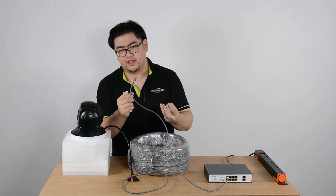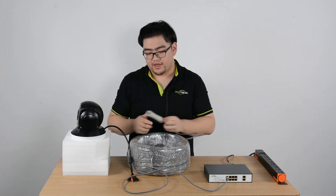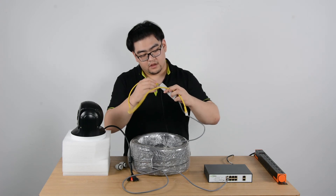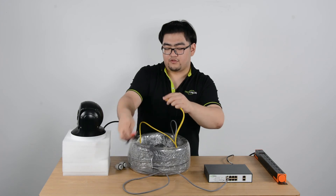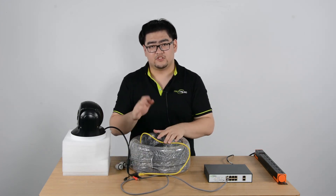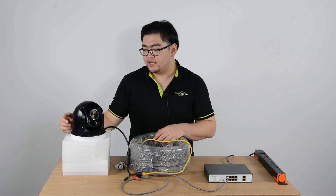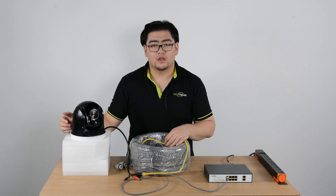The input port connects to the other end of the 300-meter ethernet cable. Then we use another regular ethernet cable and connect it to the output port. This should then connect to the pan-tilt-zoom camera. Once I plug it in, it should be self-checking shortly. See — it's operating. That means power and data is going through and has reached the device. And yeah, it's functional.